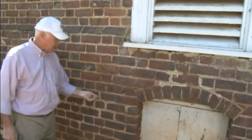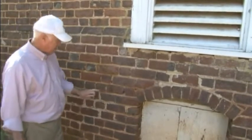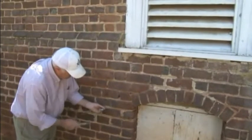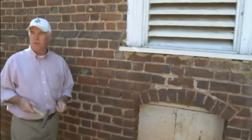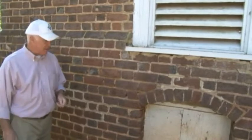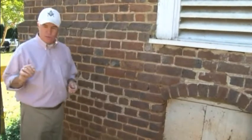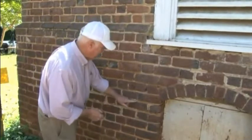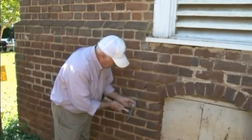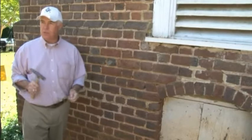The tricky part is with cement. For the skilled mason on the job — you don't let the laborer do this. You just don't. He's got to be an old seasoned veteran who's been with you for years before you let him do it. With cement, you score right down the middle of it and then break it up. Because you can go straight to hell if you don't use a diamond blade properly. I use fine diamond blades. I would score the center of this right down the center and that's it. Most times I'd use a line pin after that to chip everything away — you've got to relieve the stress on this joint.